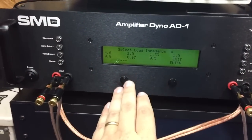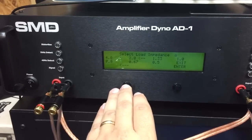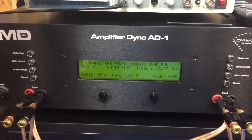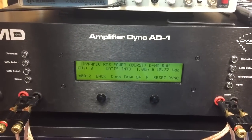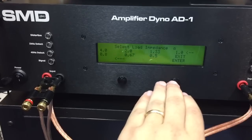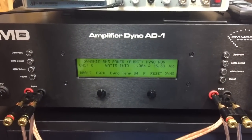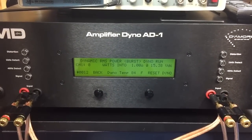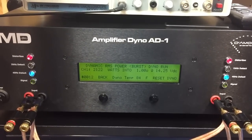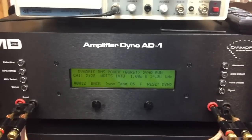Alright, let's do the last mode — let's try the dynamic run at 1 ohm mono. This simulates music, kind of like a burp, like you guys like to do with your SPL test. This is like certified term lab for the amplifier. Starting at 15.37 volts — and big D dummy has done the wrong track, let me go back. 1 ohm, let's put it on the right track this time. Start dyno, start track one — this is the burst track, 40 hertz like a kick drum. Boom, boom — there we go, 2000 watts, 2100! 2128 watts at 14.8 volts.